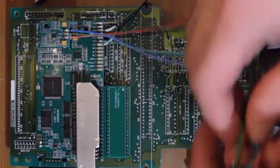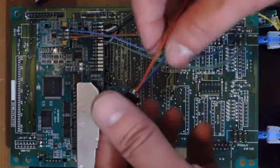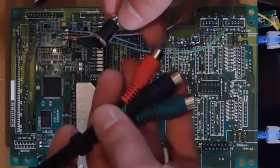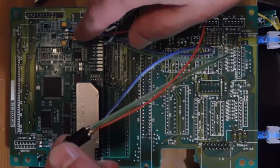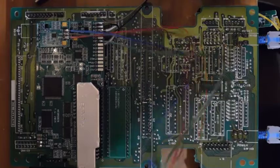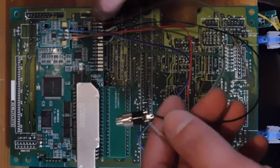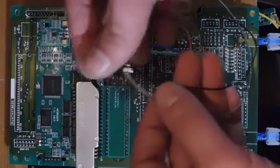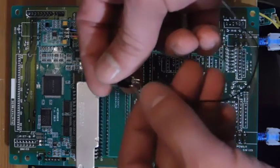I've completed all the wiring. This jack is for component video — it has four connections, giving you Y, PB, and PR. I labeled those with matching colored wires: PB, PR, and ground up here, and Y (also known as Luma) coming from the board where it says Y. For audio, I took audio from pins one and two of the CPU and brought them into pads A and B on the board. The output pad is audio out, carried by this brown wire, going to both sides so you have dual mono out of two audio jacks. Black is ground. That's all of the wiring.